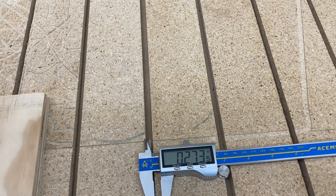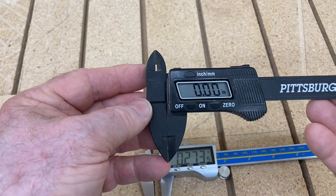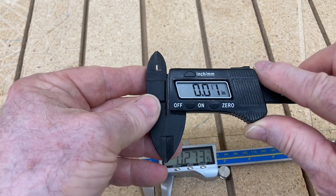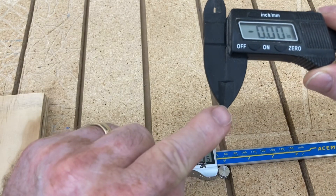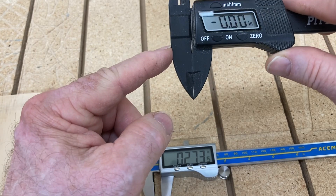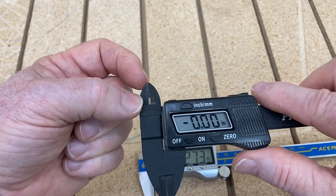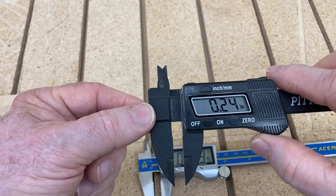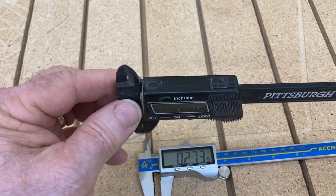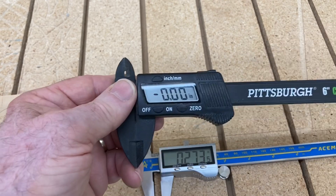That is something I quite frankly did not have with this old caliper. With that one I would only go to the hundredths, so it was not nearly as accurate. And over time, you can see right down here, this is actually wearing — you can see daylight through there, so it's not accurate. Up here at the top, you can see daylight as well, so it's not going to give you accurate measurements. The other disadvantage of this one is the battery was almost impossible to replace — it came off, but it was very tight and made it very difficult.